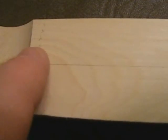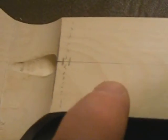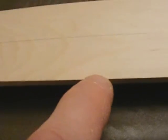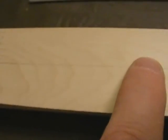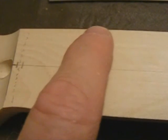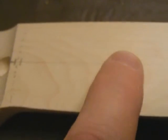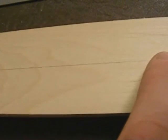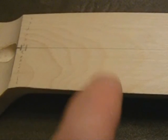When I started doing the cutting on this neck I was starting from the center and going out, and then I tried going from the bottom across and from the top down — I don't think it really matters. The most critical aspect is when you're coming to your edge that you don't get chipping, especially near the finish passes. If you're trying to take out a lot of material — I had to take out a good almost 3/16ths out of this neck — I didn't have to be real precise with my passes until I got near the end. I did over 30 passes on this last run. So make sure you don't get any chipping; the rotation goes into the material.